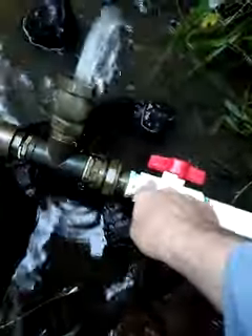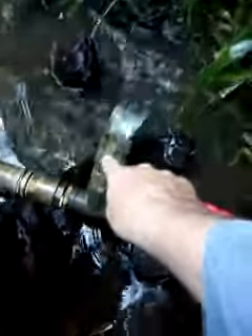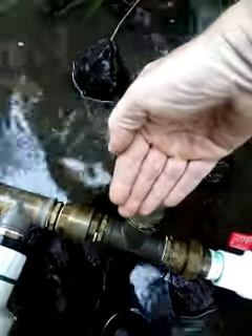It comes through this 32mm pipe and I've got a valve there so I can turn it off. Pressure comes up here and there's a swing check valve in there. I've got it leaned over slightly, which gives me more pressure — it takes a little bit more to swing the valve up. If it's straight up, that's normal. If it's leaned over this way it'll run a bit quicker but you won't get as much pressure. Straight up is normal and you get a bit more pressure and height but not as much water flow.